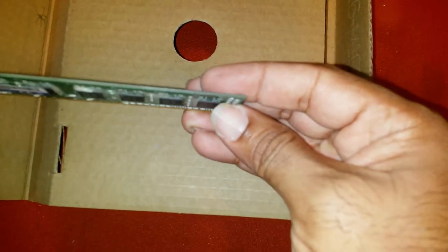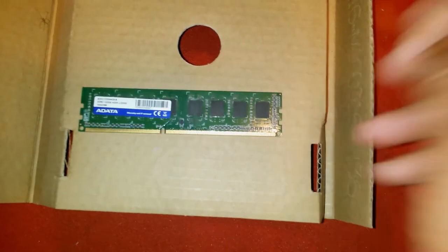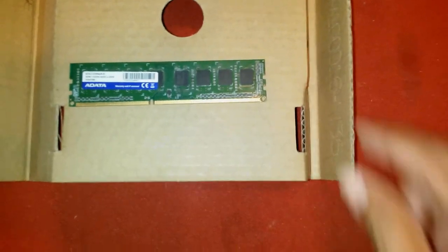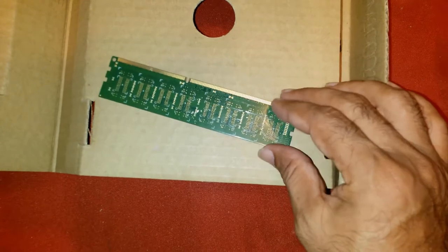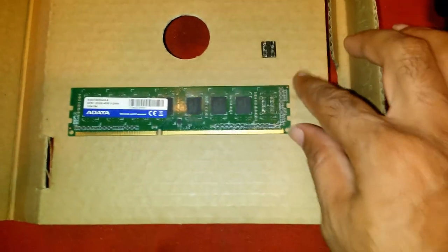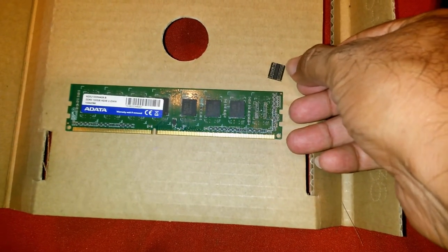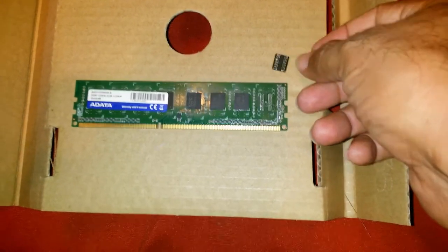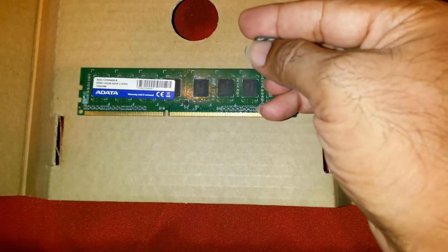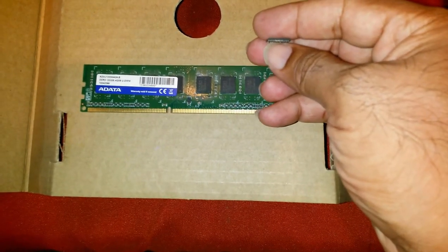You can see the side of it — it is possible to see those balls. I'm going to have a look at this BGA chip just to see how many contacts it has. Interestingly it's 13 down by 3, so 39 pins on each side — 78 pins total. This is really, really thin, about 1.2 to 1.3 millimeters including the case.